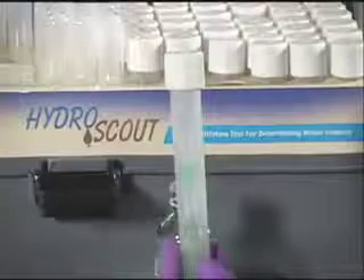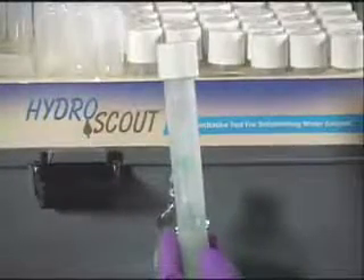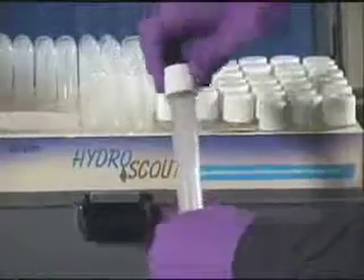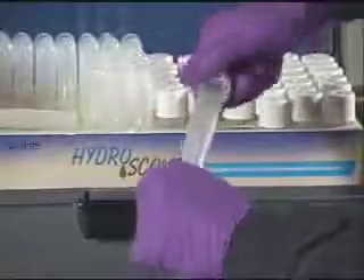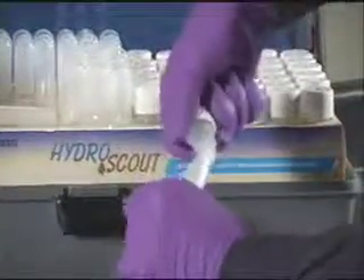The sample is ready for analysis. Please follow the procedure for lubricating oil analysis in your manual. Important: do not distort the tube when inserting the septum or tightening the cap, as this will change the volume of the reaction tube.